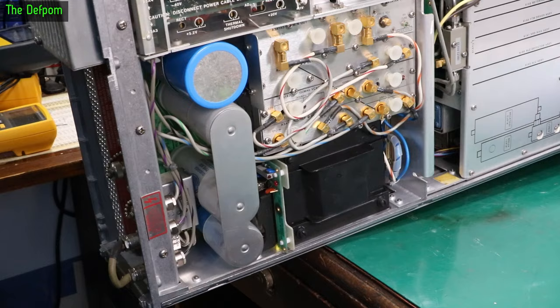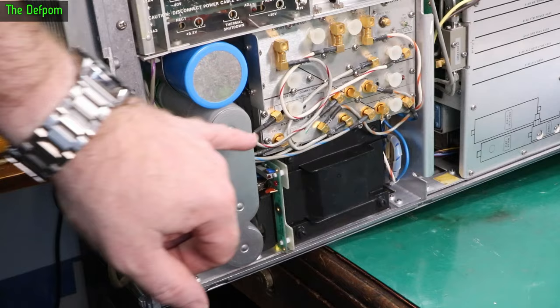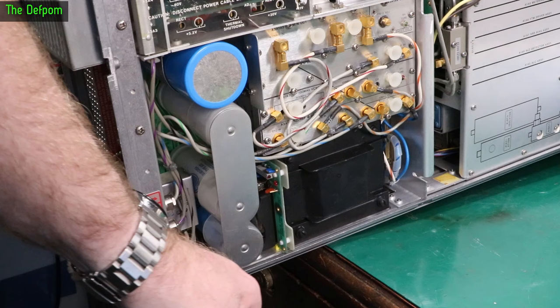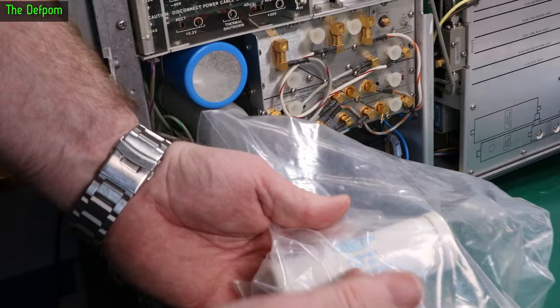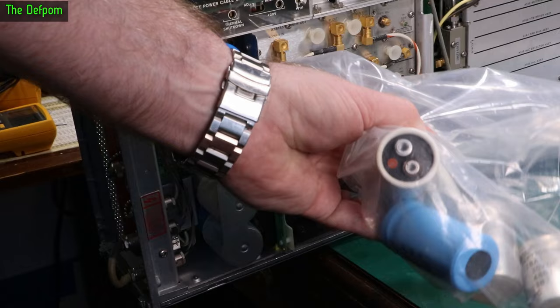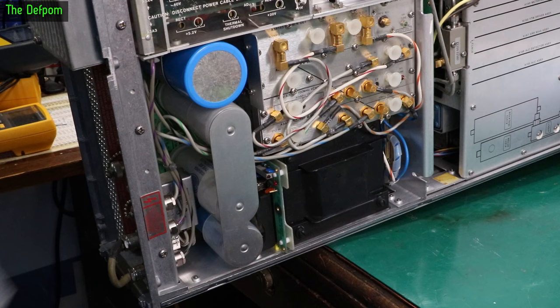This is the top side of the unit, rear left corner. There are four capacitors in here — these are the ones I need to replace. This one here has already been replaced by someone — I think his name was Gavin — and he actually gave me a bag of caps. I think this is the original one that had been leaking; you can see corrosion on that post. I had to do some minor repairs to the circuit board, there was corrosion on the traces and I think it actually ate through a trace, and I was able to clean it up and solder over it.